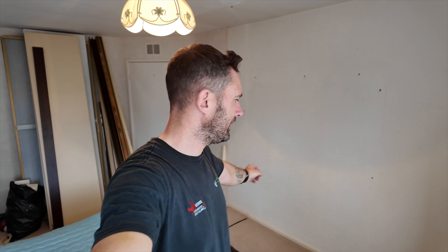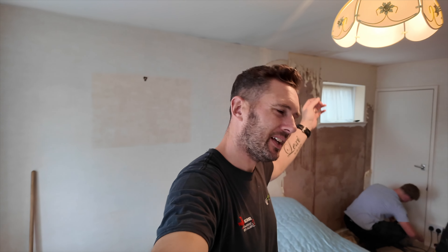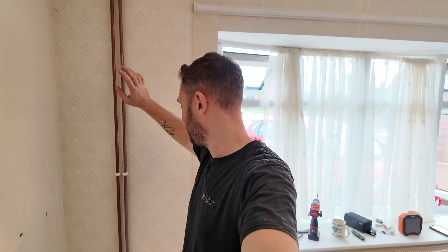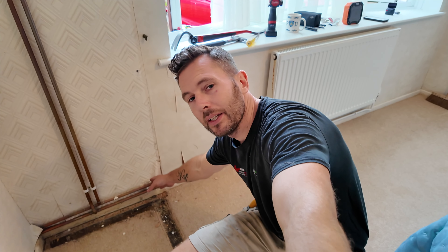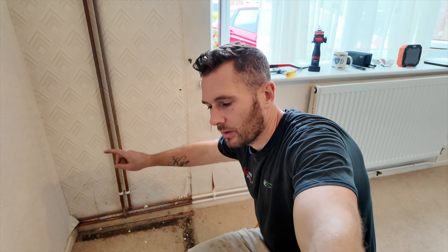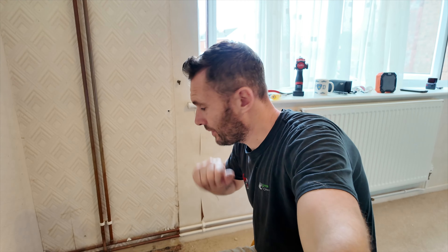Wardrobe's done and out of here — Jack's got it. Jack is doing a decent job; it is a horrible job but he's living the dream. The pipework: these pipes are still going to be within the wardrobes area — I just need to check with Steve whether they're going to be boxed off the wall. Down here we've got pipes that from that point would need to be chased into the wall. The radiator flow and return feeds the radiator on the other side of the room as well, so we don't want to kill off all the water feeds.